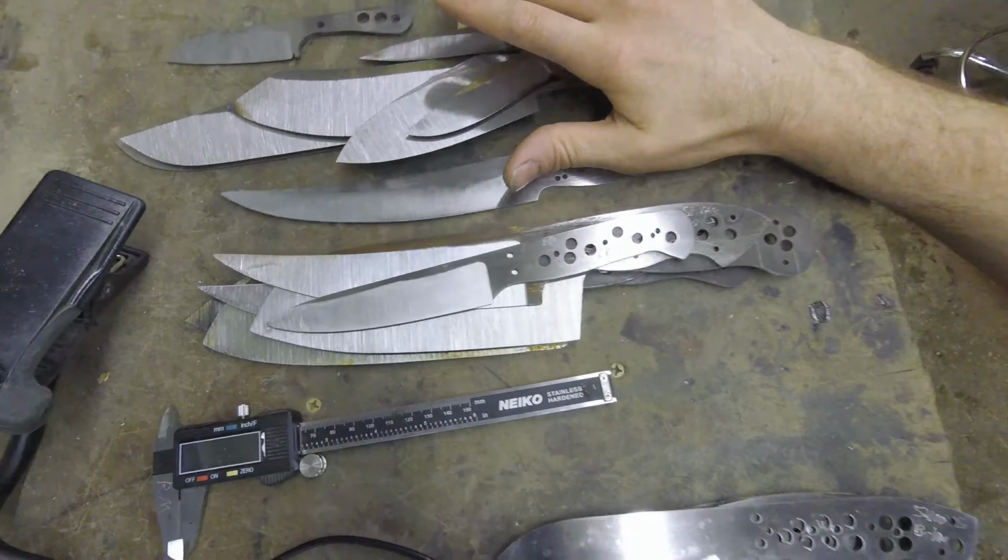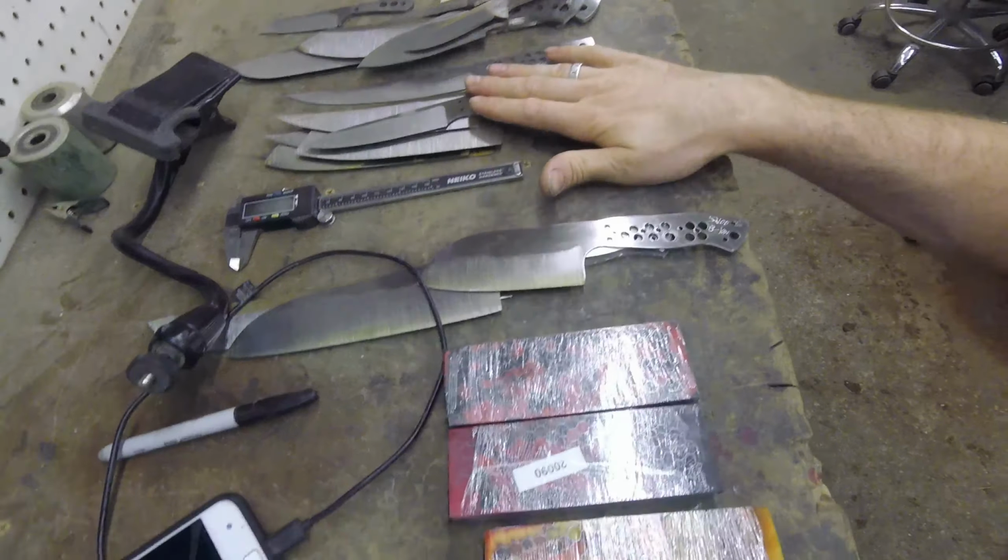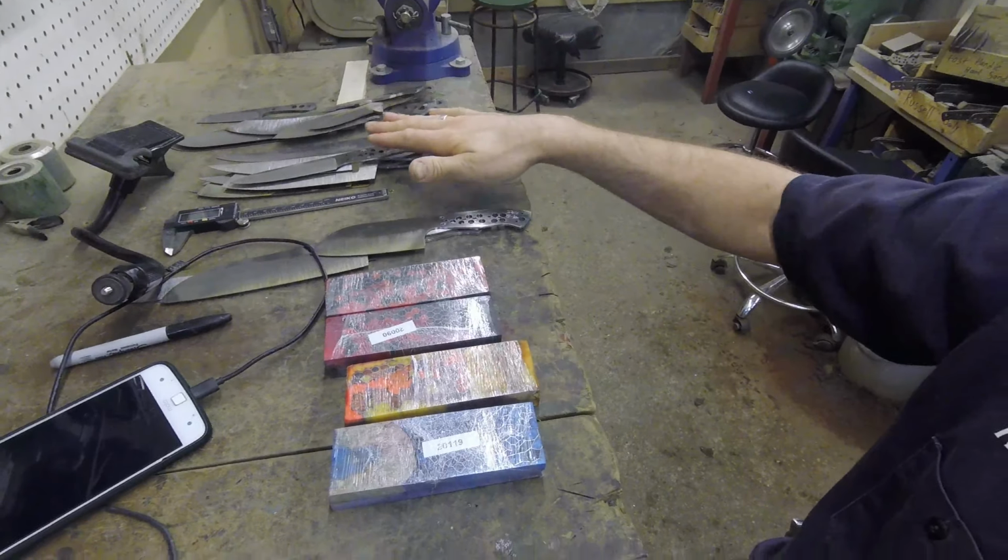These have already been cleaned up at 80, I believe, and then these need 80 and grinding and stamping. So I'm going to do that with all of these knives, get them ground on 80, get them cleaned up a little bit, and then stamp them, straighten them, put them in another pile, and then I'm going to see how many more knives I can get ready for heat treat today as well. These will be some stock and some custom